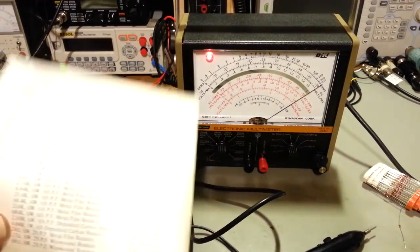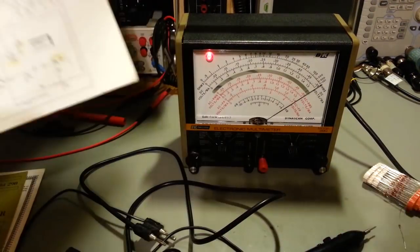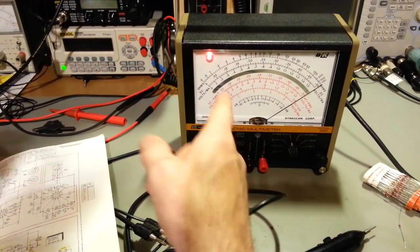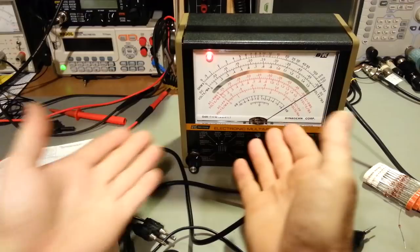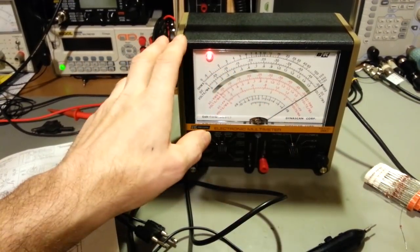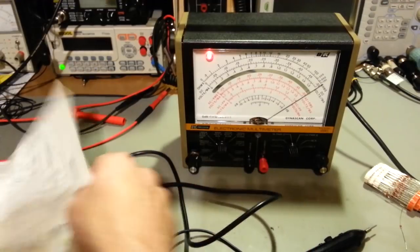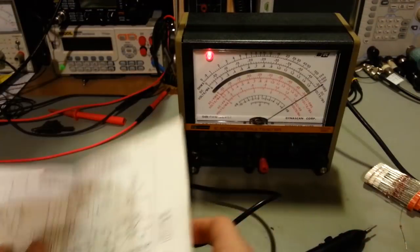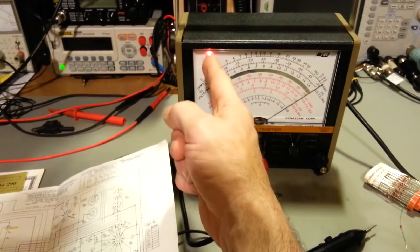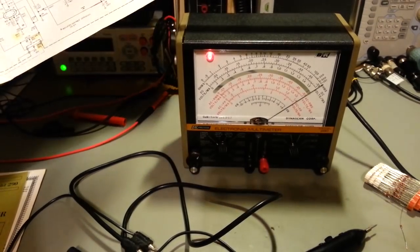And if we grab the schematic here, I can actually show that. Now, I have personally never seen one. This meter apparently came in two configurations, like this, with an incandescent light bulb with that modification, or the way the schematic actually shows it, that should be an LED, because there's a transistor in here that would control the LED. Well, that's not an LED. So what we have, let me get a pointer here.